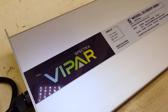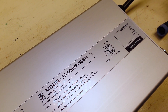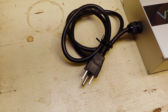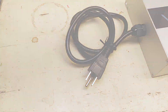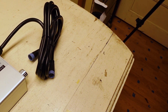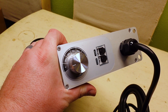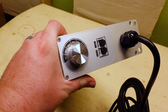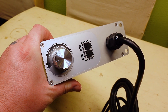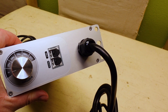The driver is enclosed in a really solid metal case, which should help with heat dissipation. It is a Sosun driver, which seems to be a pretty common manufacturer for bar style lights. The wall plug is on one side and is fairly short, so you may need an extension cord. On the other side are the power connectors, which are considerably longer. The driver is adjustable, starting from zero — which is off — with 6 total positions you can click into: 0, 25, 50, 75, 100, and EXT. If you want to chain lights together, you set all non-controller lights to EXT. There are also two communication ports for chaining.